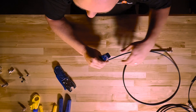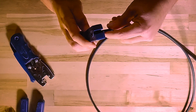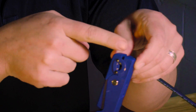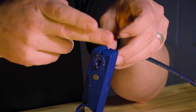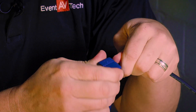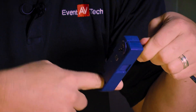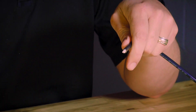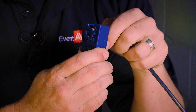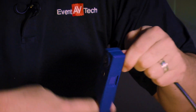In the same way as our other tool, we're going to seat our SDI in here and push it all the way to the end. Belden has all the razor blades properly laid out so that we know this is going to have the right cuts. I'm going to squeeze it down just to make sure everything's biting, and I'm going to do this rocking back and forth motion that we've been talking about. That doesn't change. I'm going to pull this off — I had a little bit of an error, but that's all right. What that means is we didn't quite make that tight enough, so I'm going to do that one more time, back and forth, and then boom.